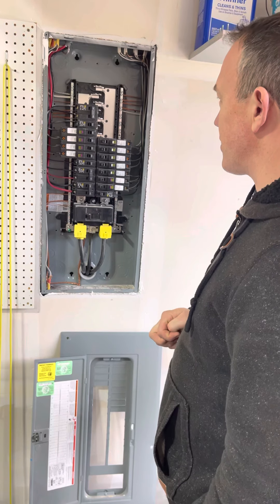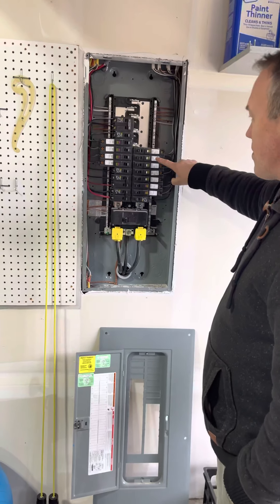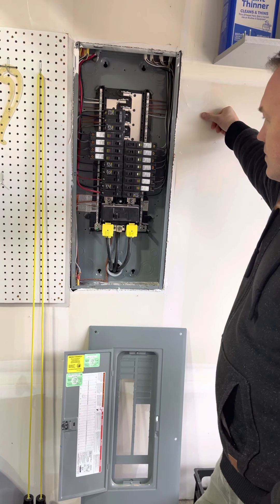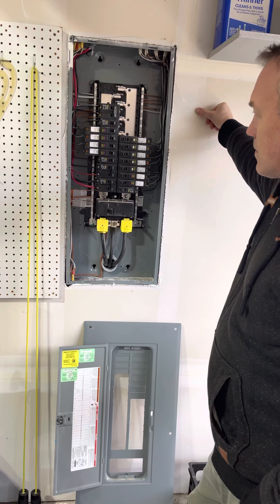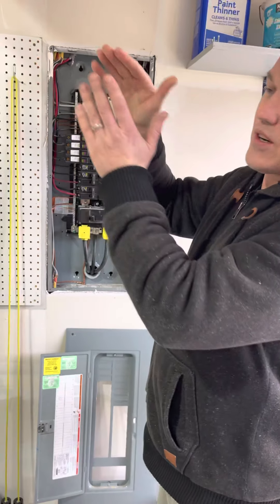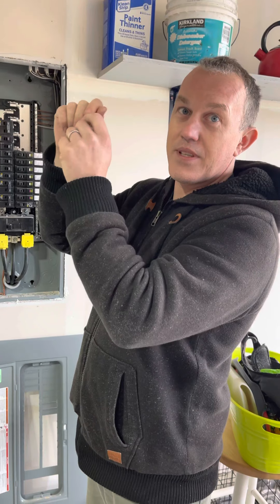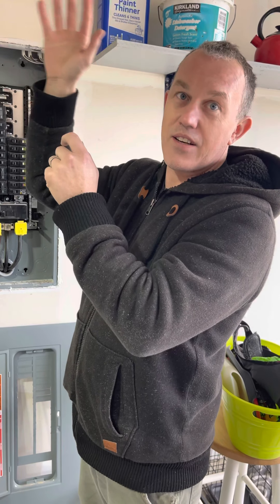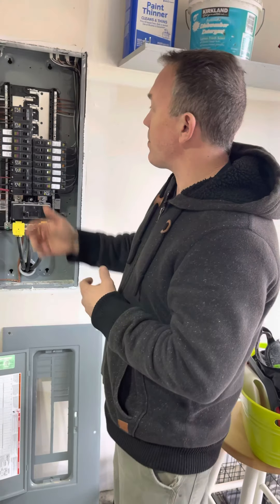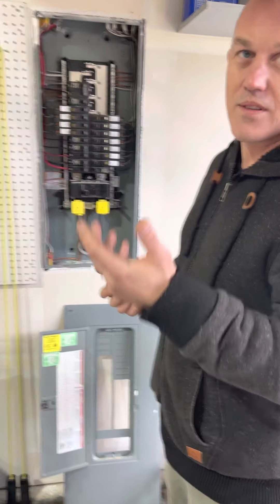The 2017 code base is when that came into effect. The arc fault circuit interrupter — what it does is, if there's a loose wire and there's a potential arc, it interrupts and stops it. In the house, if a device has a loose connection, this will sense that the connection came loose and could potentially be a fire starter — maybe in the attic on a ceiling light — that you don't even know about. This will trip immediately when the problem is first developing, rather than down the road when you smell smoke.